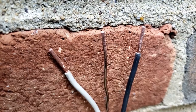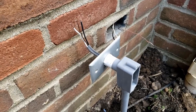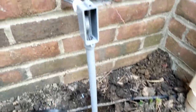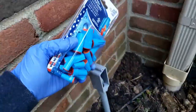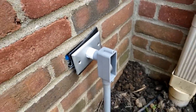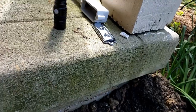So it's the next day, you can see some daylight here. I stripped our cable and got the three wires showing. Yes, this one does have a ground, which you should. I'm showing that you should put some type of waterproof gasket out there to keep things sealed up. I did sand the tips of the wires to make a better connection. There are the wire connectors — these have dielectric grease inside, so it makes a better connection and it's also waterproof, or so they claim. I twisted them and got them inside the foundation. Now we just have to tighten it up with those screws and we'll be ready to go.